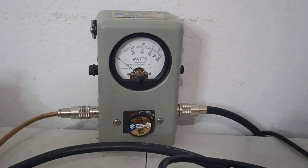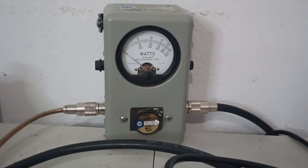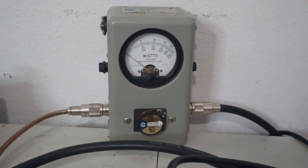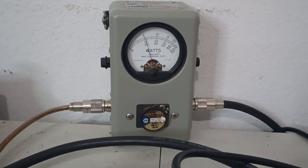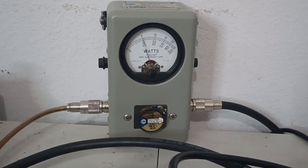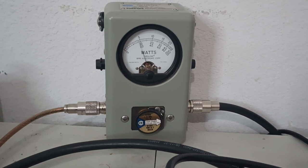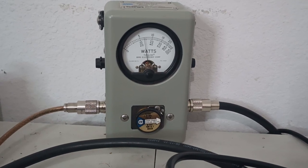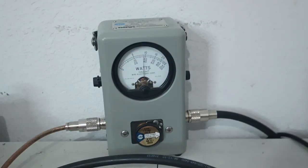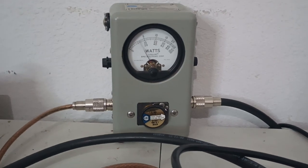280 average, 275 average. And for the folks out there that say stupid things like, why does he say audio into the mic when he's checking power? It's because we want to see the maximum amount of power it does. I have no problem just talking into the mic like this and showing you what it does just talking into it. But a lot of people want to know what the max an amp can do. And to do that, you go, audio, audio. So there you go. That's why I do that. It's not to hide or try to inflate numbers or anything. I have no interest in doing that.